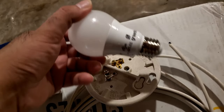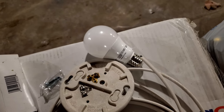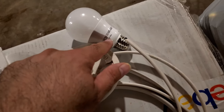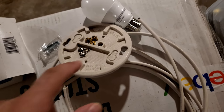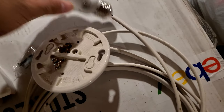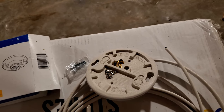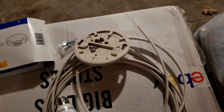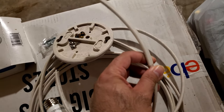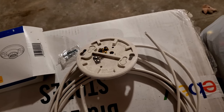Of course there is a limit to how many you can do based on wattage. This says 660 watts maximum. The LED bulbs I'm using are like 9 watts each, so if you have 10 of these you are only consuming 90 watts - well below the capacity of the wire and fixture. So if you keep it on LEDs then it should be fine. But if you have halogen or incandescent bulbs that consume two to three hundred watts each, you may be looking at burning some of these. This is for dry locations, not outdoor.